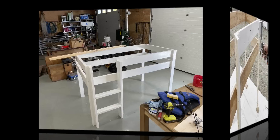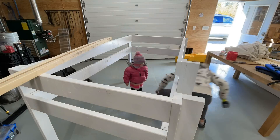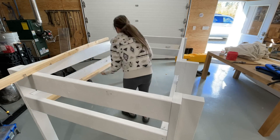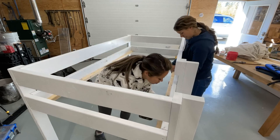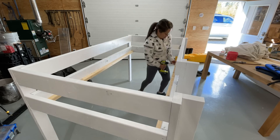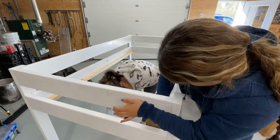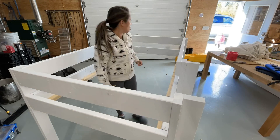Here it is all ready to go. For the mattress support system I'm using two-by-twos, attaching them flush to the bottom of the bottom two-by-six on both sides. Two-by-twos are readily available, pretty inexpensive, and easy to work with — I'm using the same screws. From there I can just throw the bed slats right on top to complete the support system.